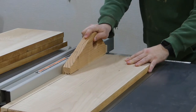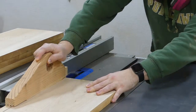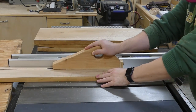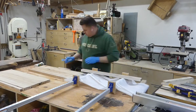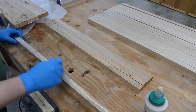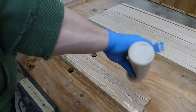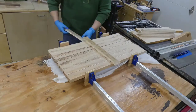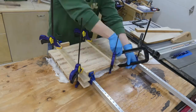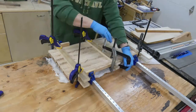Next, I cut my boards into pieces just over one inch in size. I ended up with about 16 of these strips, so the next step is to glue them all back together, turning every other piece 90 degrees. I learned that end grain cutting boards use a lot of glue, and I use Titebond III, which is a food-safe glue.